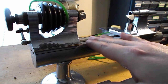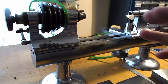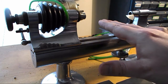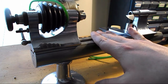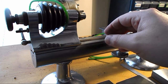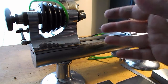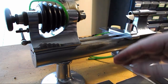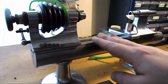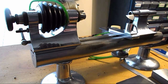Welcome back to my watchmaker's lathe carriage project. I've basically rethought almost the entire concept here. If you've watched any of the other videos in the series, you saw the way that I had the linear ways shaped was in an angle. So now I'm going to copy the design — I got a suggestion to use shafting inside to guide the movement rather than relying on those ways how I had them.